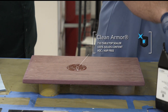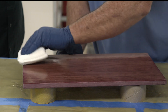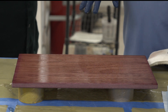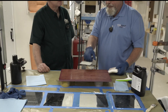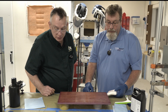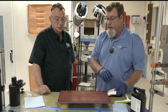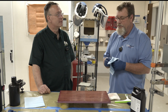I'm going to saturate this pad. It's no real different than rubbing the waxes or the finished oils product lines that most are familiar with that do finishing with the open grain look. The one thing we want to pay attention to is that we have enough material to actually integrate into the deepest pores and let it saturate. We're just depositing and spreading, and we've got some color of the wood coming up there, which is great — that means we're pushing in. I keep the light above me so I can see where we're at.